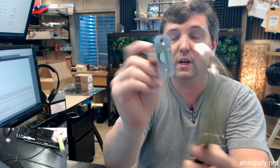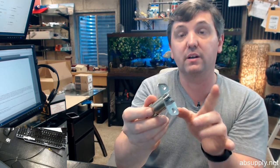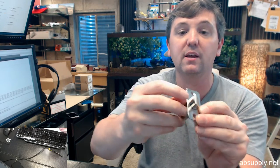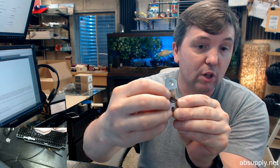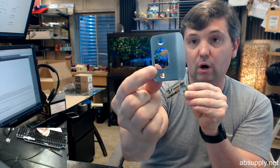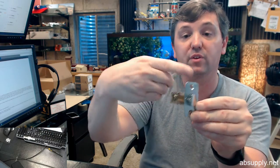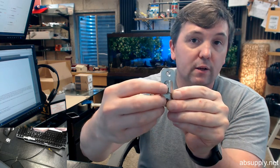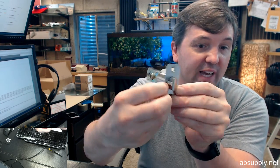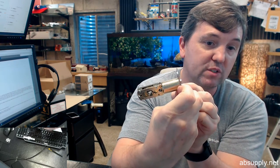That's common. This is a deadlocking latch. That is what you would have on keyed functions, the 53 and the 80, so that when the latch bolt is properly installed and it closes, the door closes into the included 2 1/4 inch tall full lip or D strike, radius corners by the way and everything, that's 1/4 inch radius. When this is properly installed, the deadlocking tab is held in, preventing you from pushing the latch bolt down like you could if it was unlocked.